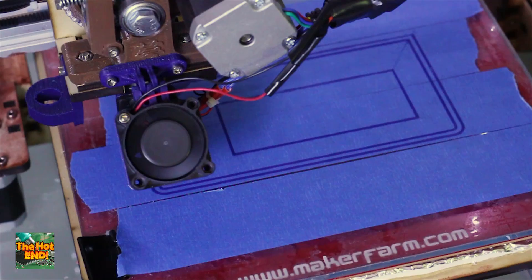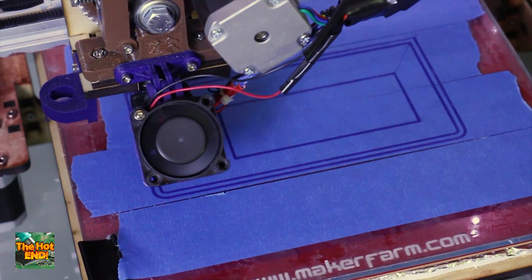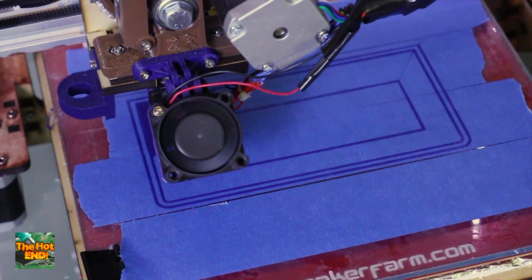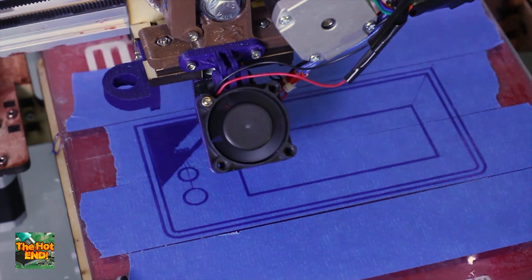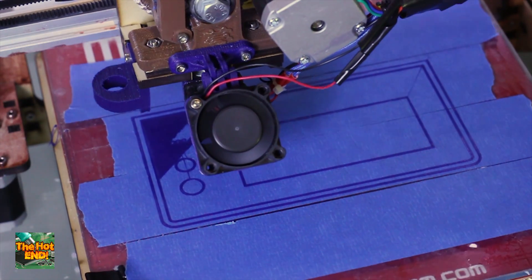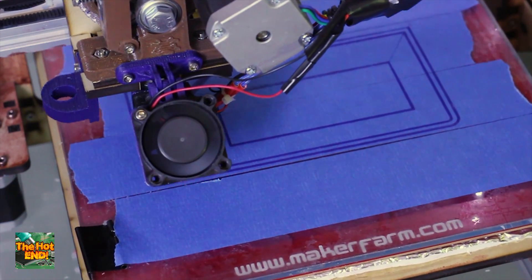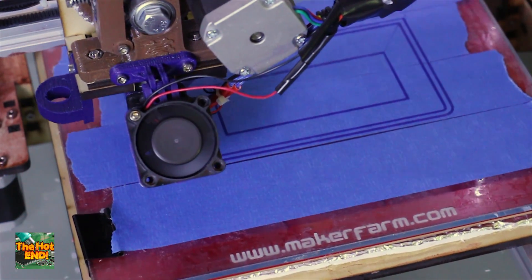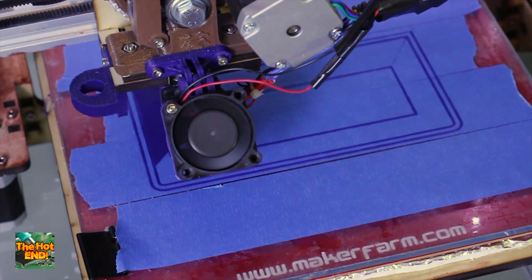This is the first print I'm printing now. You can see that the first layer has a bit of pressure on the tape but not too much. If it's too high off the bed it's going to be a thin bead that just rolls off. If it's too close it's going to be a big flat mush onto the bed and that pressure is going to stop your hot end extruding. You want half and half — basically a D shape on its side. Most people level their beds using a piece of paper under the hot end: move your hot end around to three or four points on the bed and slide a piece of paper under until you've got slight pressure on the nozzle, and then you know you've got a good level.